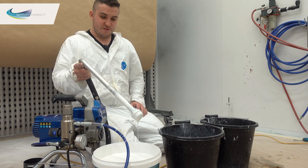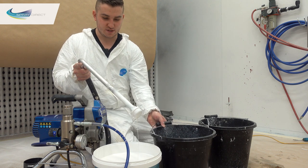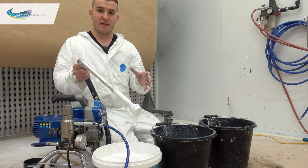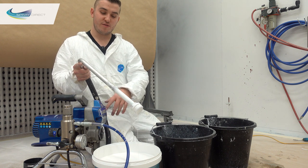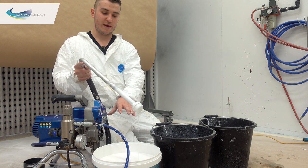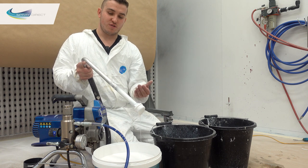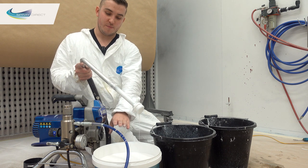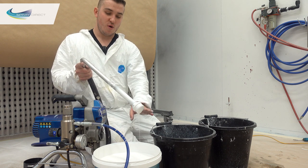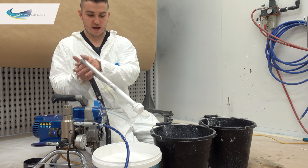Once you're done letting this drain and going back into the paint bucket, we can stick it into our clean water. Then what we're going to do is chase the paint through the lines and get as much of it back into our paint bucket by using the water to suck up after and push the paint along, then stop it going into our paint bucket once we know the water is going to come through. So I'll show you how we do that now.